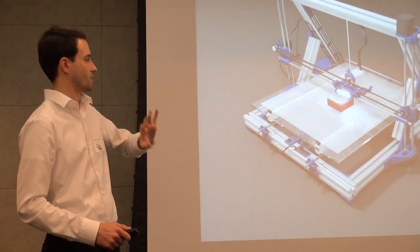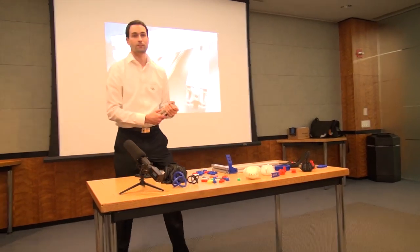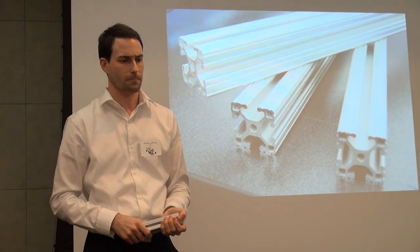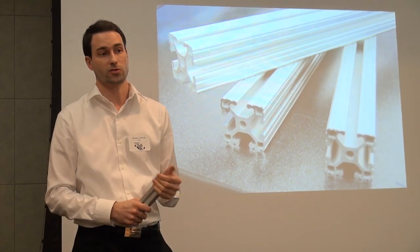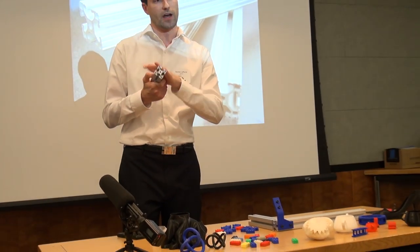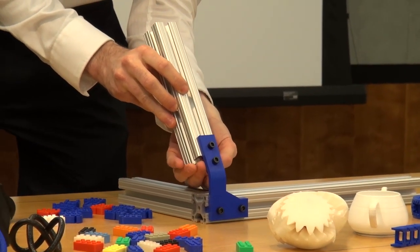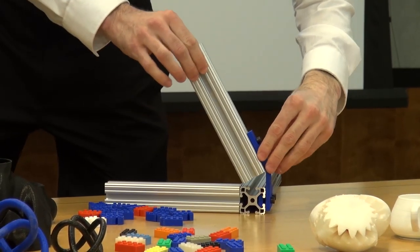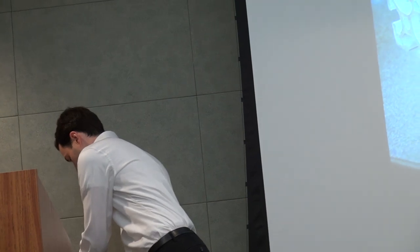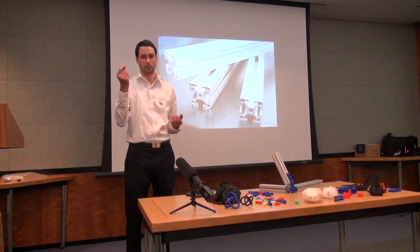This is the prototype I built for myself, just to have fun, something in our living room. The framing system, which I actually have a sample of here, is 80-20 — an amazingly strong aluminum extrusion system. I've seen it used mainly for electronics racks or carts or things that need a lot of durability. For the printer, it was really nice that you could easily latch on parts. If you design a part you want to latch on to your printer, you can just slide it on after the fact without dealing with threaded rod. I've created filament holders, fans, anything — it literally just slides on and you bolt it in with an Allen wrench. There's a T-nut system you have to purchase with their system, so I designed my own with a standard quarter-inch bolt, which was much cheaper.